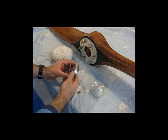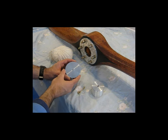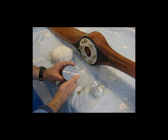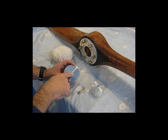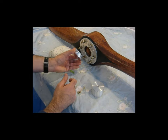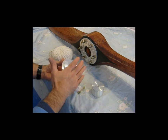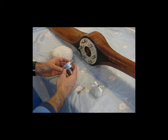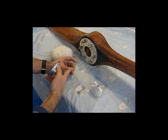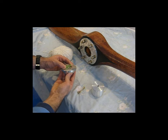First is this piece of aluminum that I machined — I believe it's 6061, though it doesn't really matter. It's got a sixteenth-inch hole drilled all the way through it, and it's got a good chamfer on both ends. This fits the propeller hole and will basically self-align up in the propeller. This flange is what the propeller will actually rest on. The idea is to have the string pass through here, and it will hold this little bubble level that has the graduation marks on it. The string will get tied to this and will rest on the piece of aluminum.